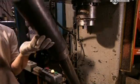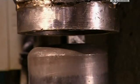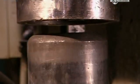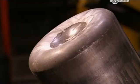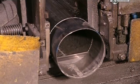This press forms the closed bottom end into a concave shape that reinforces the base. A bandsaw then slices up to 10 cm off the other end, which will become the top of the cylinder.